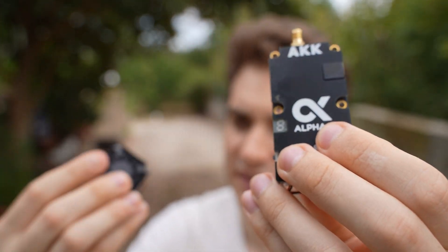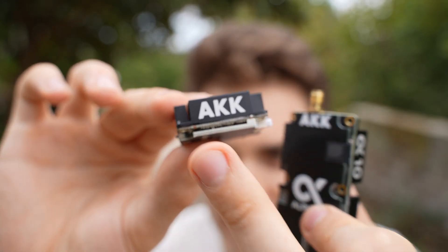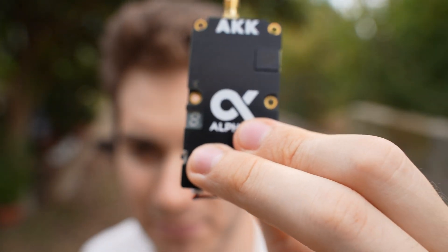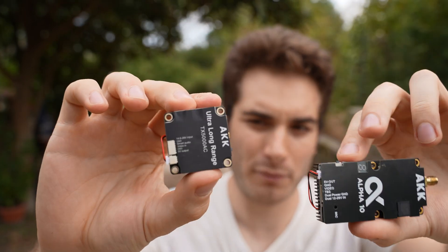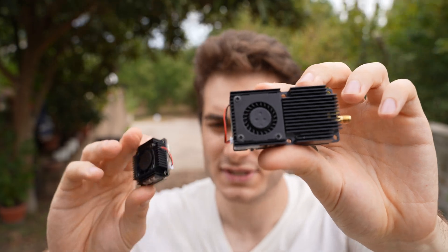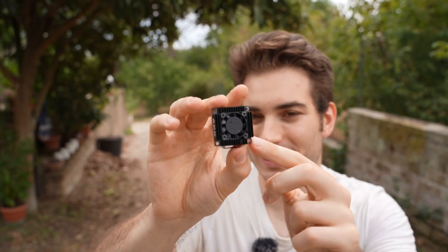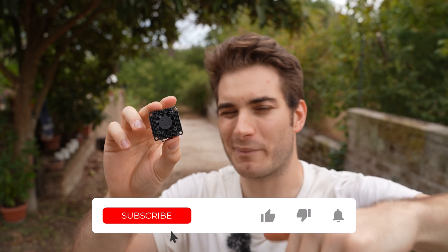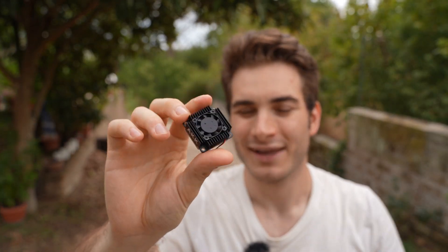Also, this has a screen — a raw OLED — which I kind of find easier to read, because you have all the bands, channels, and power displayed at once. Here you have to cycle through them. The last difference is that the Alpha line has a 12-volt minimum voltage, while this one needs 14.6V. They recommend going with 6S anyway, probably because this being bigger has better step-up voltage regulators. So, if you are looking for an incredibly powerful VTX that you can actually fit inside your drone, I can totally recommend this one. Remember to like, subscribe, and comment on this video — let me know what you think about this VTX and going 5 watts of analog power. Check out the links in the description below — you help the channel a lot. Stay safe and happy flying. Bye!